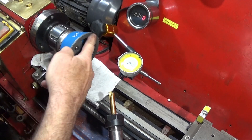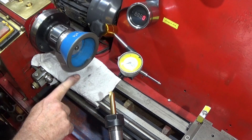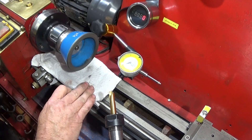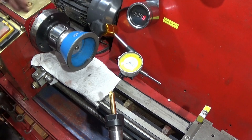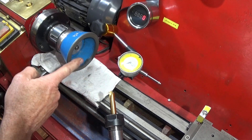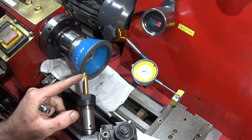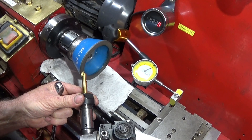Now I have my diamond wheel set up in the ER40 collet chuck. It's a very fine diamond wheel - I think it's about 600 grit. I cover the ways up with kitchen tissue cloth. Don't use any other cloth because it could get caught up in the spindle. I stick this to the ways using a rare earth magnet on the other side as well, and this protects the ways from any debris which comes off the tool or the diamond lapping wheel. You can also get these cup wheels on eBay. I bring the carriage in making sure that the tool is in the center of the diamond lapping cup wheel, and you can adjust the cross slide to achieve that.